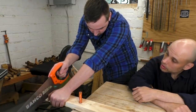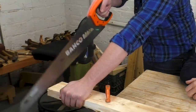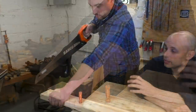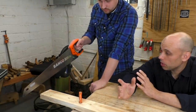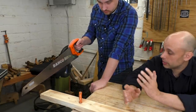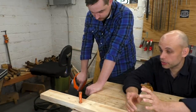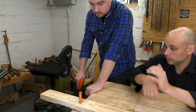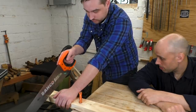And now what are you going to do? Now I'm going to pull back. It sort of looks to me like you're pushing down on the saw. What you want to do is just let the weight of the saw do the work — really just be drawing backwards and not trying to push it into the wood. And then when you go to actually make your cuts, just be pushing forward, not down at all. That'll make your saw wiggle. All right, so now that I've made the trench, I'm going to make the kerf.